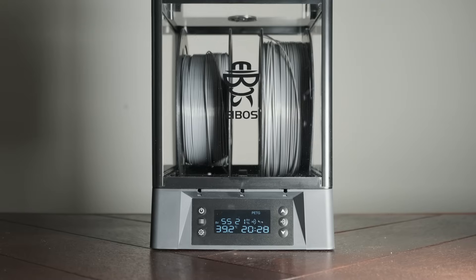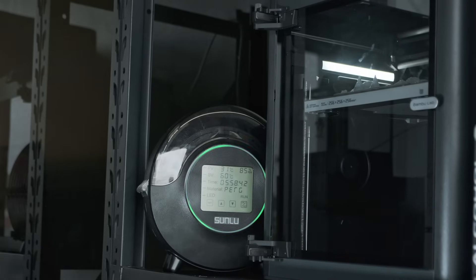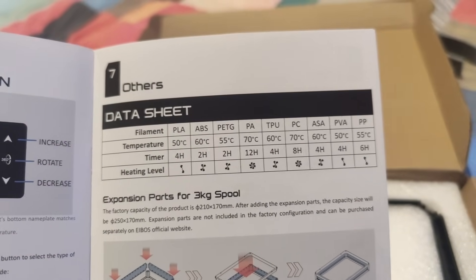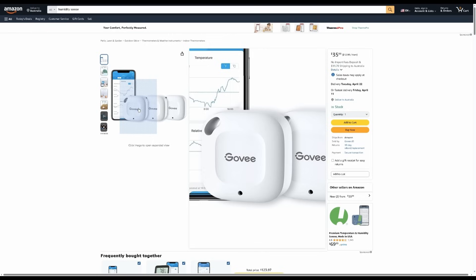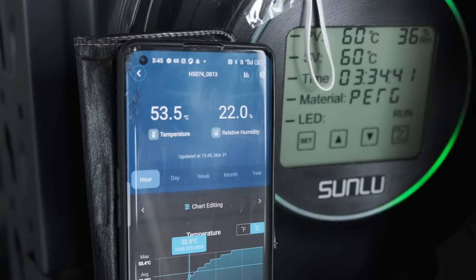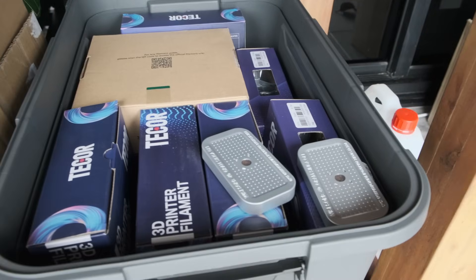Here are some tips when you're using a filament dryer. Keep the relative humidity inside your dryer as low as possible, ideally below 10%. Be mindful of the temperature — too hot can damage the filament, and too cold won't dry it out effectively. But if you follow the drying guides from the manufacturer of your filament dryer, this shouldn't be an issue. You can also use your own humidity sensor to monitor the drying process accurately. I use one that I paid for myself — I chose it because it was the cheapest and had Bluetooth connectivity so I could monitor the humidity from an app on my phone. This is not only helpful in the filament dryer, but also handy to put in your dryer boxes to monitor moisture levels so you know when to recharge the desiccant bags.